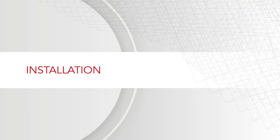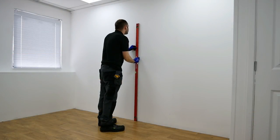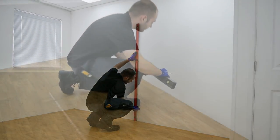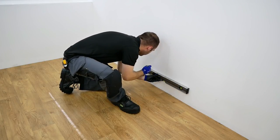Once you're happy that the radiator is prepared for installation you need to consider the location where the radiator is to be installed. The radiator position may be predetermined by existing pipe positions or may be dictated by the room shape and features. For this installation we're using the centre of our wall which is 4 metres long, making the centre point 2 metres in. Mark the central point where the radiator will be positioned and draw a line with a spirit level to show the vertical central position. Then, allowing a minimum floor clearance of 100 millimetres, draw the horizontal mounting position using a spirit level.